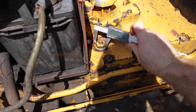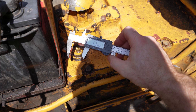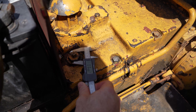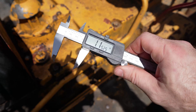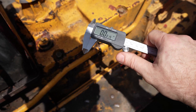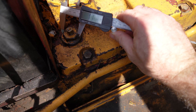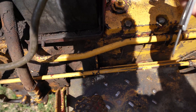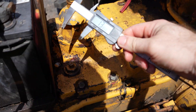What we're going to do is design and 3D print a cap to go over that and keep water out. Using Harbor Freight calipers — let's zero them out. The opening takes about an inch and an eighth; I'm getting readings of 1.165, 1.152, 1.158. Height-wise we want it about 1.3 inches — we'll just say inch and a half.